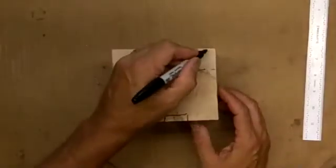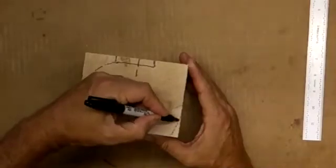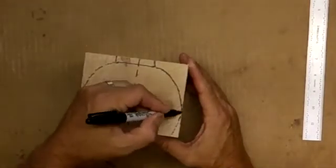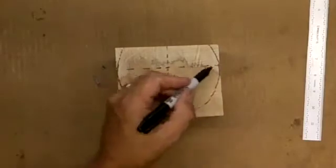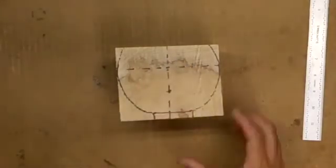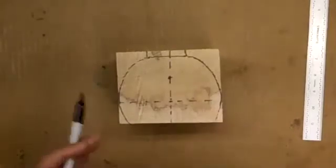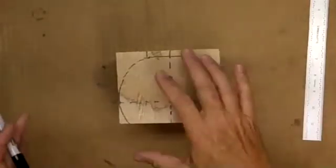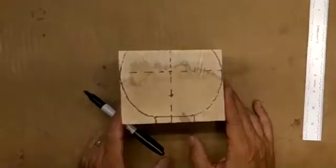So now we're just going to take a look at where the bowl is going to be. So that's how I'm going to turn it. Come over here. And that just gives me a sense of looking at it so I can see where I'm going with it and see how it's going to be and see how it relates to anything else in the wood that's interesting. In this case, I really like this stuff. It may help me. It may be really nice. It might have been prettier in some case to have all the interest down below so the wave cuts across a planar part. So I'm splitting the difference there between the wave following the growth rings and then placing the figure of the wood appropriately. And those are some design choices that you can make as you go forward.